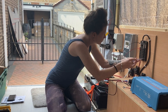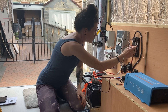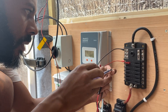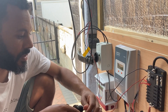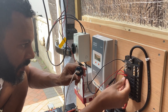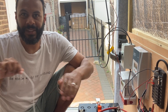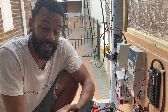Now that we've got the solar panels completely working and they are charging the batteries, we've just realised that even though we're not putting our full electrical system in at the moment, we can start putting different elements in. So we've decided that we're going to put a USB port in, which will allow us to charge our phones in the van while we're working. That is the negative screwed in - I need the fuse. And once I pop that in, this should light up. There we go! So you can plug your phone in now and charge it in the van. That is exciting - and it's all coming from the sun. Self-sufficient. It's charging!